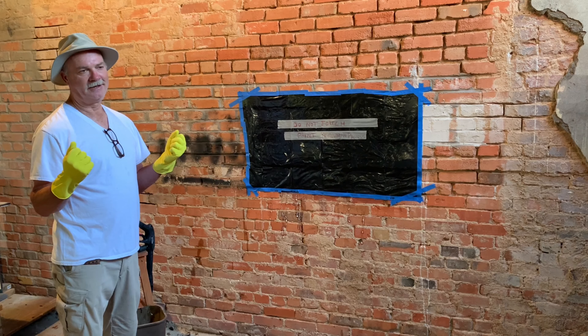I'm going to apply a little bit of stripper to the wall to show you how thick it needs to go on, and then — last night — we pre-applied an area here and covered it, so we're going to do this and then move on to the removal part. As you can see, it's going on thick. We want it thick; we don't want it to dry out. That is about the consistency you want — thick enough where it's trying to run. You're going to get about 65 to 80 square feet per gallon on the heavy-duty paint stripper, and it is available in one-gallon containers.